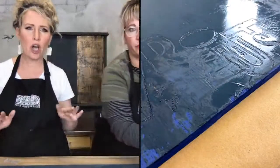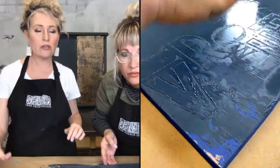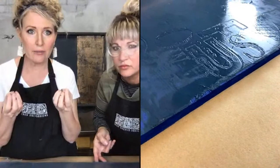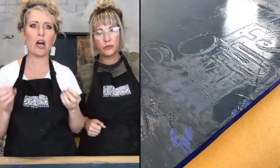I think that may be enough to give you the idea of that one step, the stamped and press. We trowel on a nice, generous coat with a nice light touch, and then we let it set just a bit. You see the edges drying a little, and then you impress the stamp in it. Certain stamps are going to give you a certain look. The more fine detailed stamps will be harder to see what it is. It's not as clearly defined, but they still give a beautiful finish.